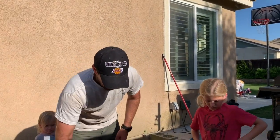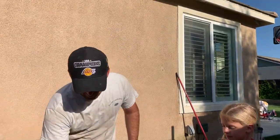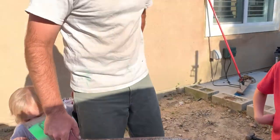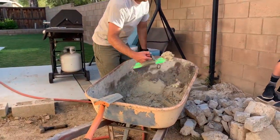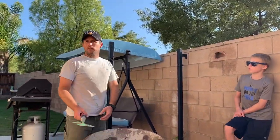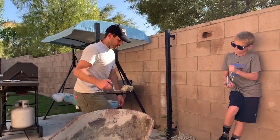This is all mixed up — a pretty strong mix, a lot of cement mixed with sand, so it should be a pretty strong mixture. I already got the hole a little wet; it's better if it's kind of damp that way it sticks better in there. Okay, I'm gonna start by throwing some in.